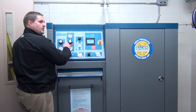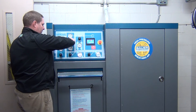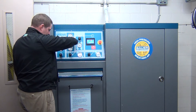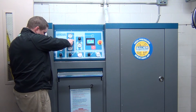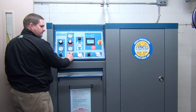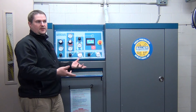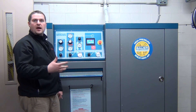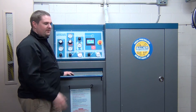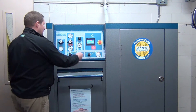Check out your door — will it fill with the door open? It will not fill with the door open. Down here you're going to build up the pressure to what you want it; we're going to fill it to 4,500, right? I like to crack these because you don't want to hot fill. If you open it all the way it's going to hot fill. Gas rushing through it causes friction, which causes it to warm up, which also causes the air to expand. It'll tell you that you have higher pressure in there than you do an hour after it's sitting and cools down — you'll lose that pressure. At 4,500 PSI, if you get it real hot quick, cool for an hour, you're probably going to lose 200–300 PSI. So crack it — you see your gauge; this is telling you how much you're filling it at.